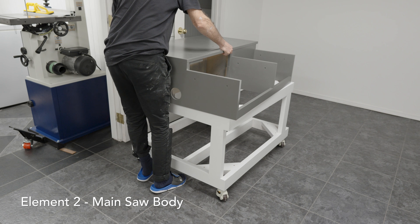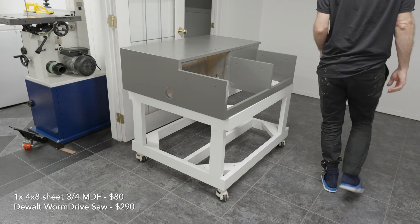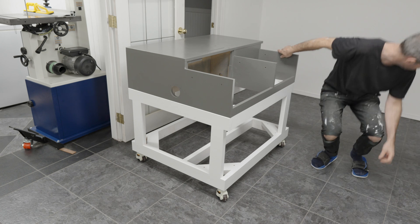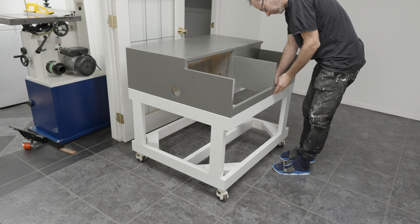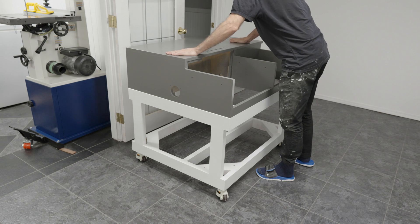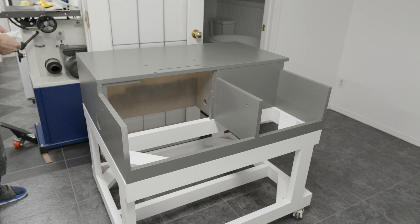The second and most important element is the main saw body — effectively a box with a circular saw mounted on the underside. Theoretically I should make an attachment connecting it to the rolling base, but for now just the weight keeps it in place, and during all my tests it didn't shift an inch. The two elements bring the total height to a comfortable 36 inches. I primed and painted the MDF and added wax to the surface to harden it and make it non-stick.